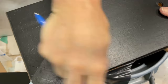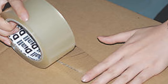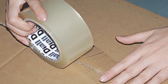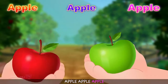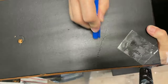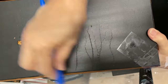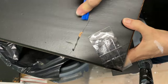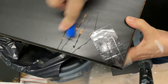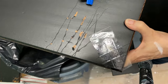The durability of Beyond Paint compared to chalk paint was tested using a scratch test and a modified version of the adhesion test done by Paint Testing Labs. I refer to it as modified because I used packing tape and they used a special tape. This was the same packing tape I used with the chalk paint test video, so I'm comparing apples to apples when it comes to testing adhesion between those 13 different chalk paints and Beyond Paint. For the scratch test, I used the same hard plastic pen cap I used in the video to test the 13 chalk paints. One of the 13 chalk paints was a DIY recipe chalk paint that did surprisingly well compared to the expensive commercial brands.